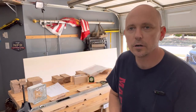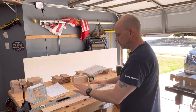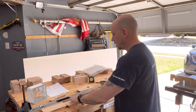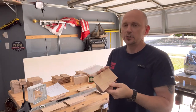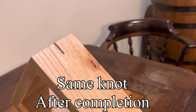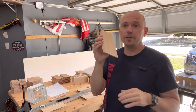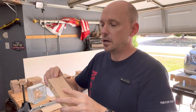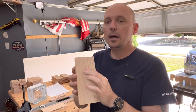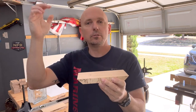For the wood, once I've got my pieces cut I use a straight edge to push everything against for taping. This is also when I figure out which boards go on top. The two middle ones form the top of the triangle, so I want the best grain there. For instance, this one has a cool knot I want featured. Based on my wood frame notes, I use an inch and a half forstner bit, coming down an inch and seven eighths, then drill. You can batch these out easily with a drill press stop and fence.